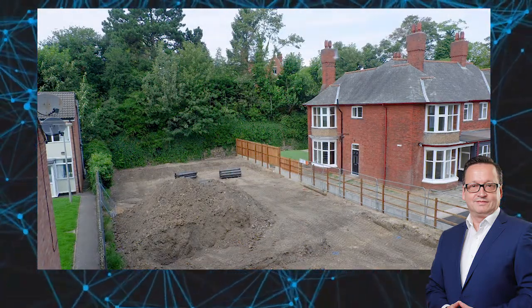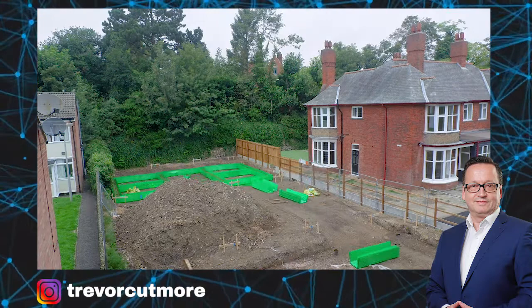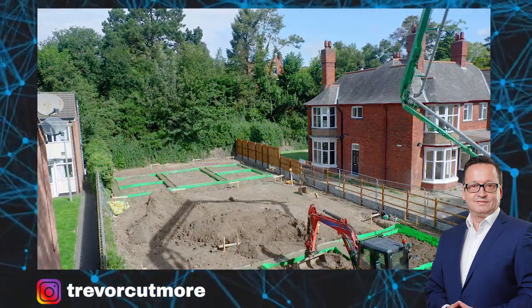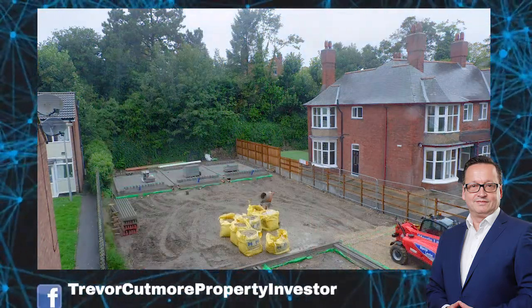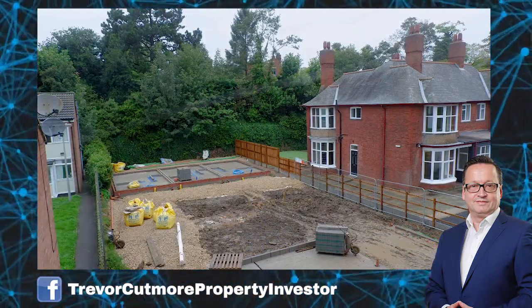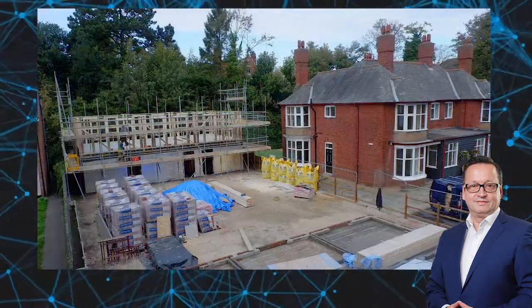This was a great project, and something that, again, by having to do the piling, we saw different ways of doing foundations, as you can see here. This is, again, strip foundation with piling. It's put in there, lays it down, and then on top of that, we go and put the base down. Obviously, there's a lot of damp membrane. We're doing protection. These are timber-built frame houses.